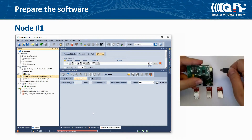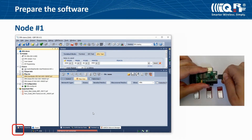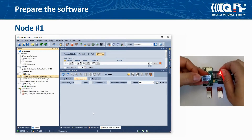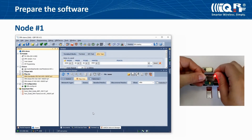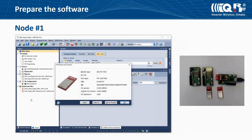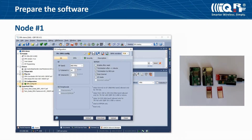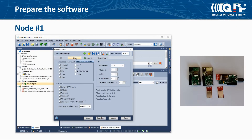Connect the CKUSB kit to the computer. A red indicator will change to green. Insert the first IQRF transceiver into the CKUSB. Press Ctrl+M to check TR module information and check the OS version. Set the TR configuration. On the OS tab, a band and a working channel can be set — a node will inherit these from the coordinator during bonding. On the DPA tab, check the options for embedded peripherals, other parameters, and RF settings.